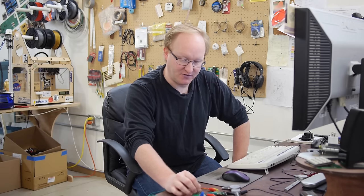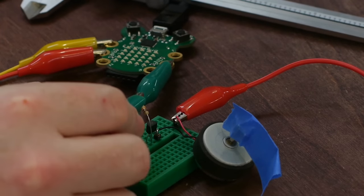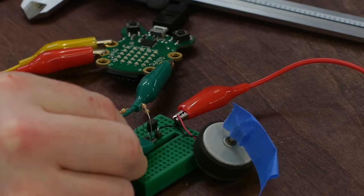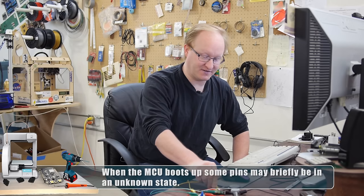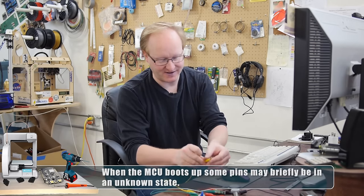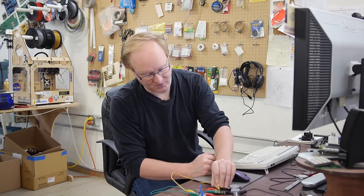I'm going to add a 1K inline resistor from the transistor base to an output of the Code Bug using the alligator clips. This is a 10K pull-down resistor — I'm going to connect that to the base as well. The base is where you input to the transistor. This is an NPN transistor: applying a voltage to the base will cause it to conduct through the collector, turning on the motor. By adding a 10K pull-down resistor between the base and the emitter, which will be connected to ground, it will ensure that the transistor stays off until you've explicitly tried to turn it on.